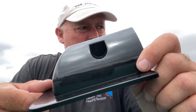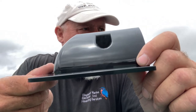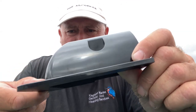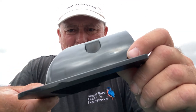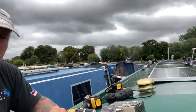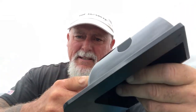Maybe that's an important thing as well. This is quite a curved roof. It's okay, it's fine. But if you tighten them up, they'll just go zip. So we want to make sure that we drill them in place. So I'll put the panels in the center, as you've already seen. The panels are in the center, pretty much. I haven't measured them, but they're about the center. And that'll be perfect. So when I put these on, I can drill through into the panel and the angle is right. So I'll show you that in a second, but I'll drill some of these first.